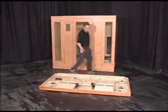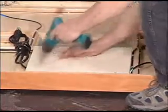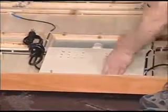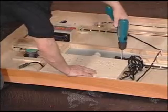The next step is going to be the roof assembly, and it's easier to do this while the roof is on the floor. There are screws that need to be attended to and tightened down — they're underneath these wood boxes called junction boxes and relays. During shipping and trucking, occasionally they will loosen up and create problems. You can see underneath this plastic lid are the junction boxes, and those screws are the ones we want to attend to. You have a Phillips screwdriver in your package for that. The two relays and the second junction box are under this other box over here.